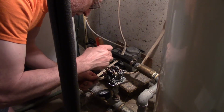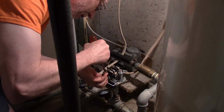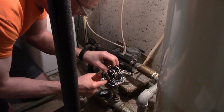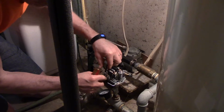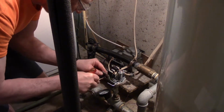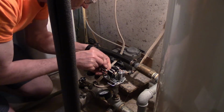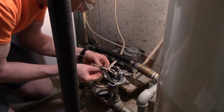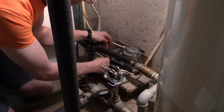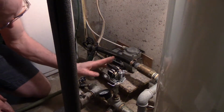And if I keep trying to tighten this nut, I'm never going to get it off. I hate when that happens. Now this one has screws on here. The new switch is all wires and wire nuts. So I got some yellow wire nuts to go with it. Get this wiring off of here, and then I will be able to take the switch housing off.